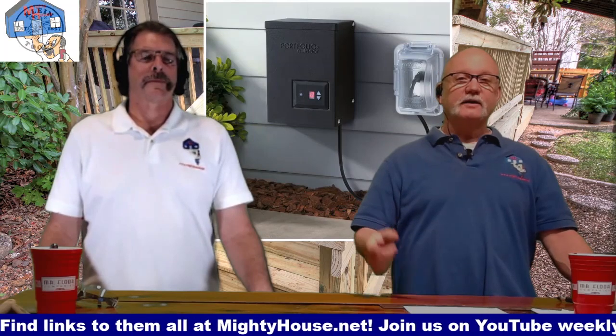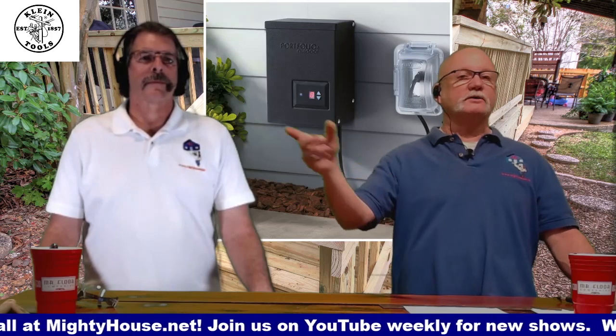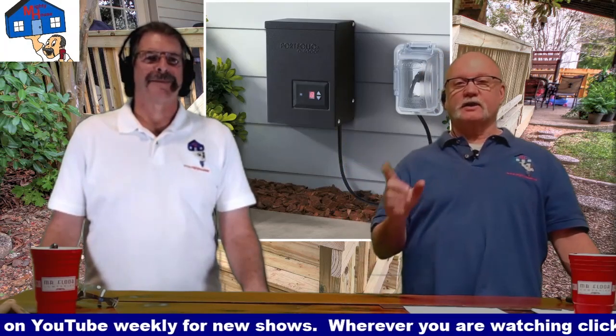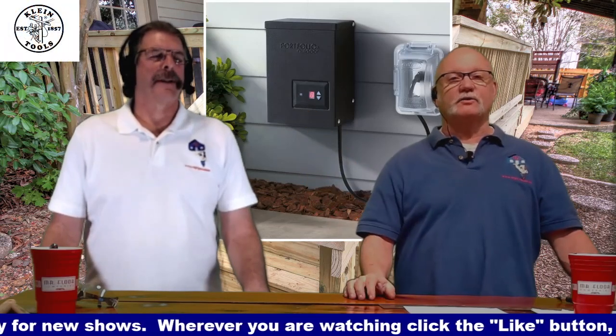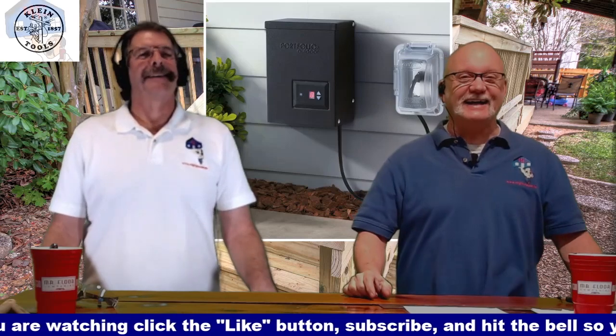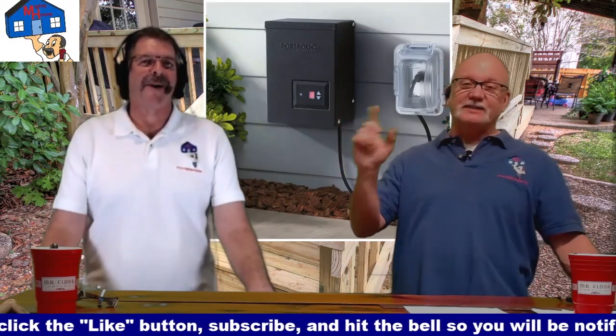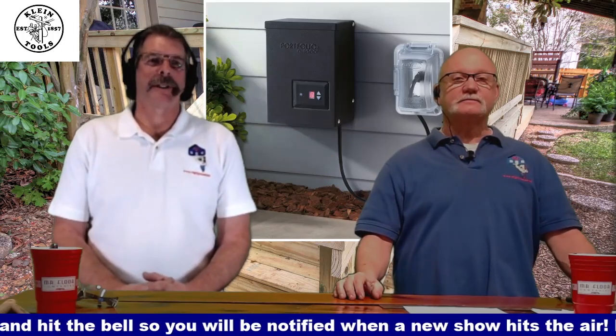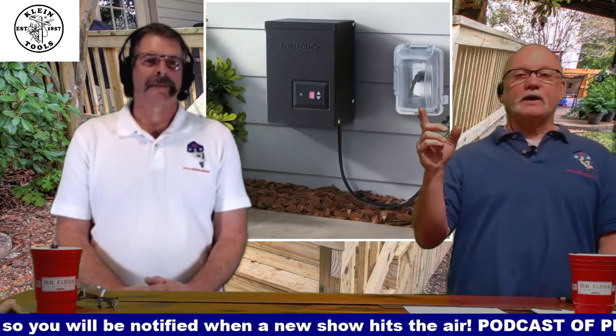So how are we going to power these? How do I control all of these crazy lighting things? Most of them are going to be off of a transformer, something like this. You're going to plug them into an outlet with that transformer, and then out of the transformer you're going to run the wires out to every light fixture. But they haven't wired in the bunch of wires that come up and tie in all of the lights yet. And I do see that they are using an in-use bubble cover — this is the correct weatherproof cover for your outlet today.